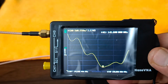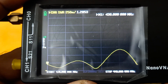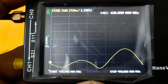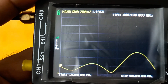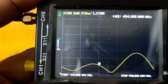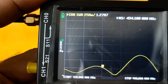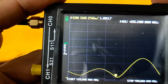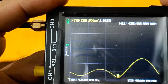I am measuring the SWR in the UHF band. I have set the marker at 430 megahertz start and 440 megahertz stop. The ham band lies between 434 and 438 megahertz. At 434 megahertz, the SWR is 1.2985. The best dip I found is at 435.4 megahertz with an SWR of 1.0666, which is an excellent value.